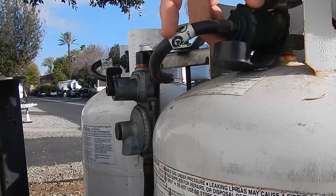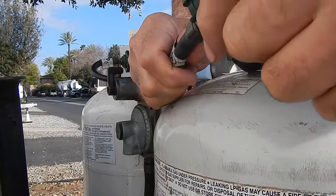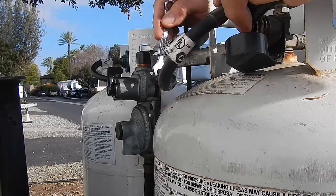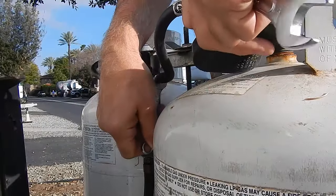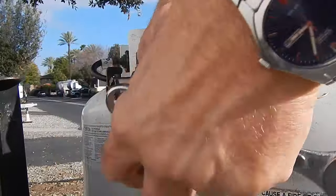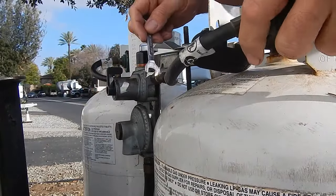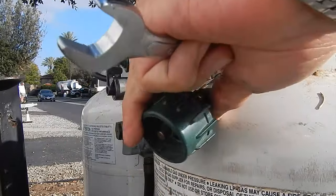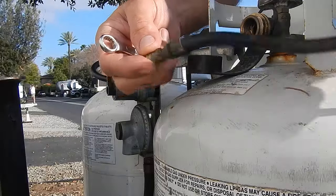I'm going to remove the coupling to the LP bottle first. It's really, really stiff — time to replace these. It can rotate freely, although I don't really care at this point if it compromises the seal on the rubber. It will slip a little bit in the rubber, but it's not intended for you to turn this without turning the whole hose, since it's crimped on tightly. You're going to have to rotate it a little bit, and there's the quarter-inch pipe thread — old one removed.